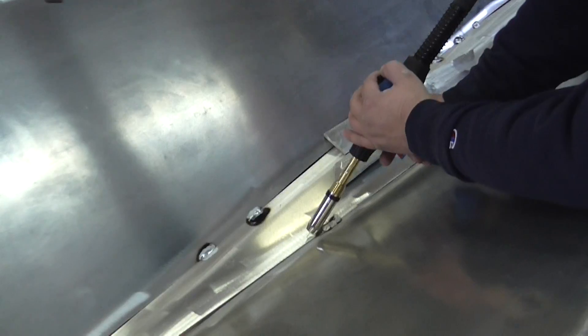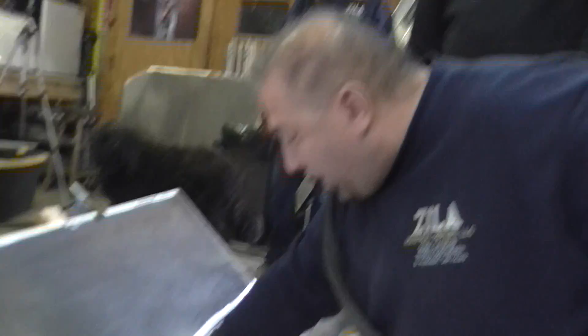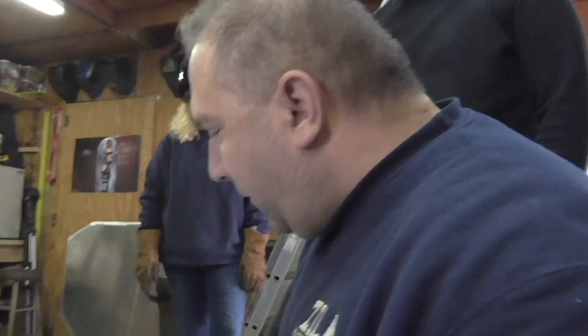When the plates are tight, I'm starting at 440 inches a minute welding along. And as the gap gets bigger, I use my left hand up here and gently start dialing it down. When I'm down to like 260 or 270 inches a minute, I can bridge these big eighth-inch gaps with the big relief on the backside without burning through. I can fill gaps up to half inch — no problem — I just keep dialing it down and bridging it. Then to get the strength, you lay a really hot bead in on the backside that gives full coverage.